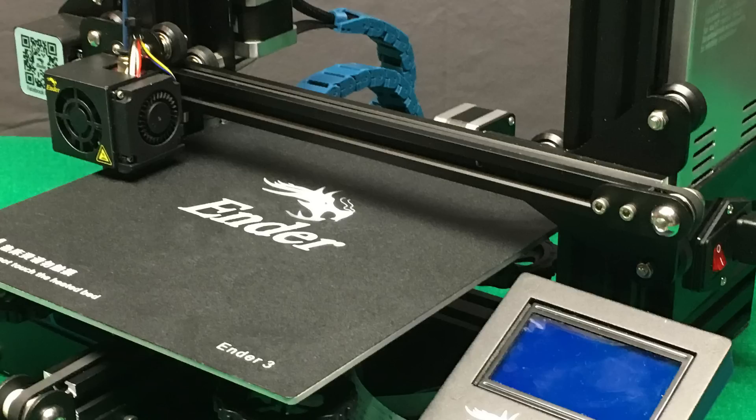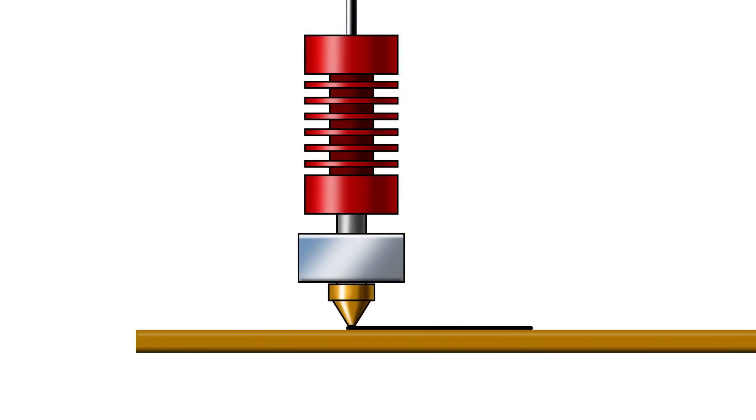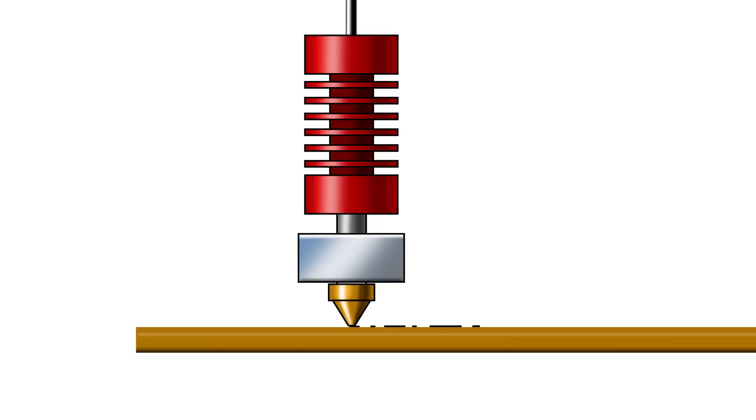To start with, let's take a look at what you want. You need to get the nozzle just high enough off the build surface that the filament can extrude cleanly as a solid line, but still low enough that it squishes into the bed and gets good adhesion. What you do not want is for the nozzle to be too high and extrude filament in mid air where it doesn't bond well, or too low where the filament cannot cleanly come out — either it doesn't come out at all, or it comes out in a broken line.